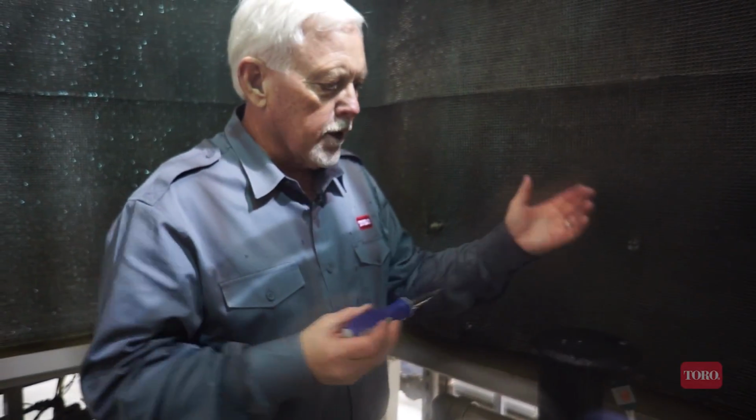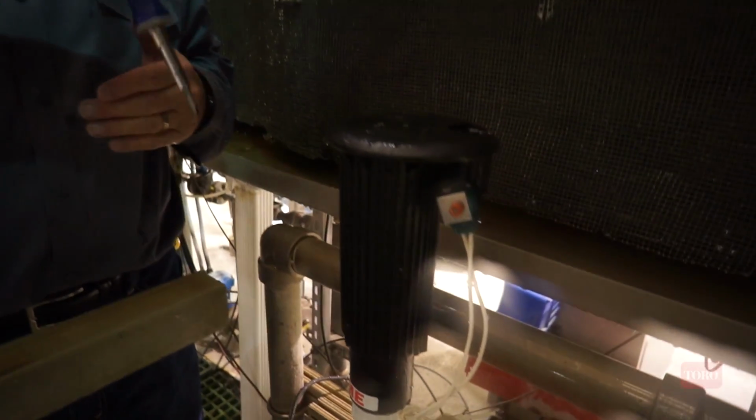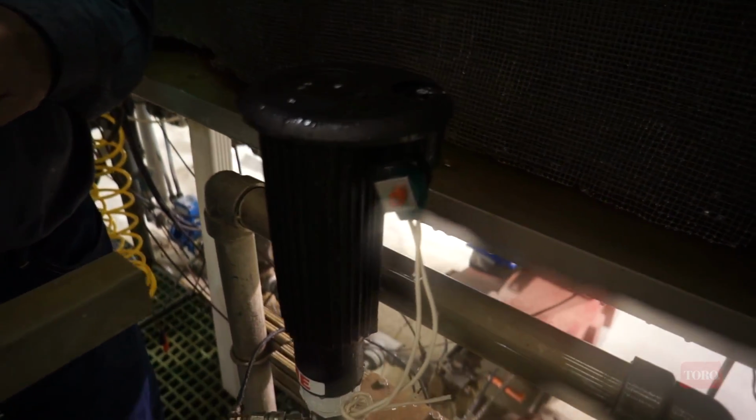So the disadvantages of the A and B as performed with the Rainbird 751, number one, you have to turn the water on to make the adjustments. It's a lot more time consuming. You have to rotate the nozzle around, put it to the full circle mode, allow it to go beyond the previous stop point, and then put it back into the part circle mode.